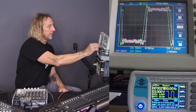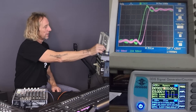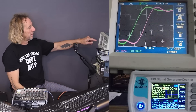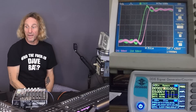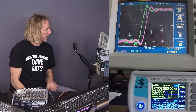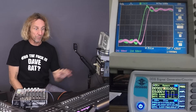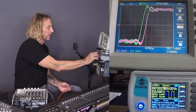Let's go further into this. Here's something interesting. If I turn off the original, this is just the two digital consoles. We can see that they're not right on top — they're slightly offset. That is because there is a different latency in the X32 than the M32; the M32 has a slightly shorter latency. The latency shift at 25 microseconds per division is about four of the five divisions, so it's about 20 microseconds less latency in the M32.